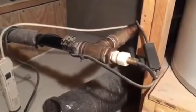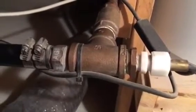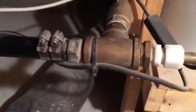So we have to somehow prevent that water line from freezing, and that's exactly what the water line heater does. It's got a label that says: water line heater, leave on during October 1st through April 31st, and plug it in right up here in the GFI. Once it's plugged in it does its own thing — there's no on/off switch. It's about 35 feet long and goes all the way out to the well head.